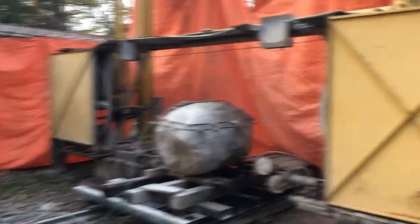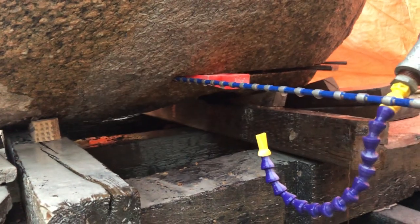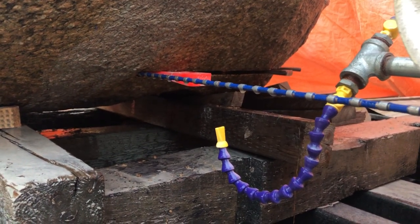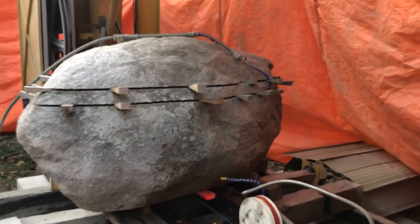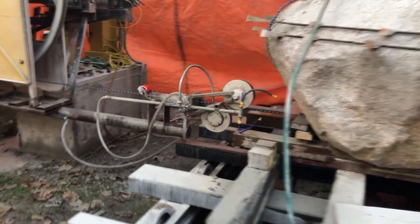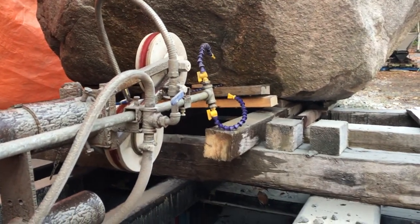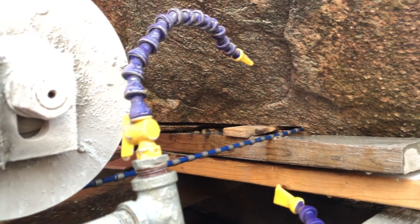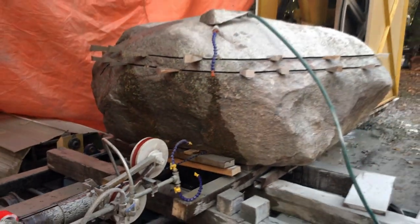Right now I'm just paused doing a horizontal cut — paused it to put in some wedges down here at the bottom. It's the first time I've done one like this, cutting so close to the bottom. But if everything works I'll be pretty happy with this, because as you can see you can do a nice level top and bottom cut without having to reposition the stone at all. I just placed a steel wedge in there — got about 20 more inches to go, cutting at 1.5 inches per minute right now.